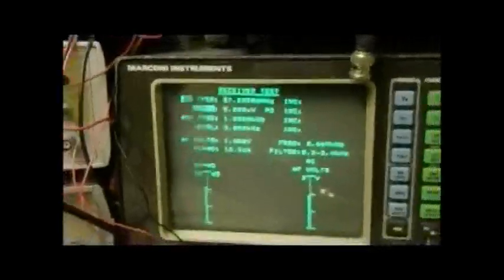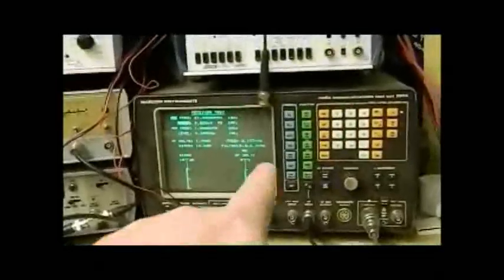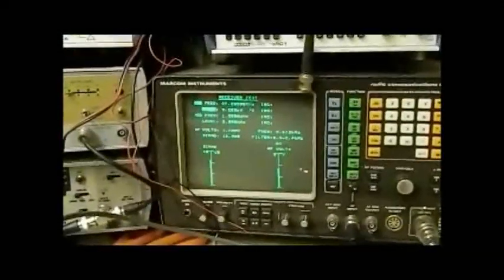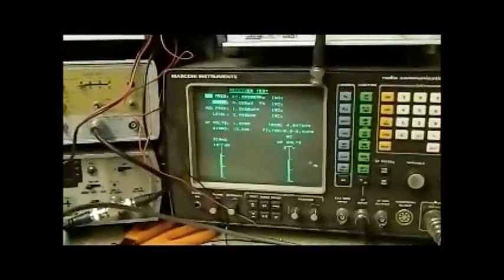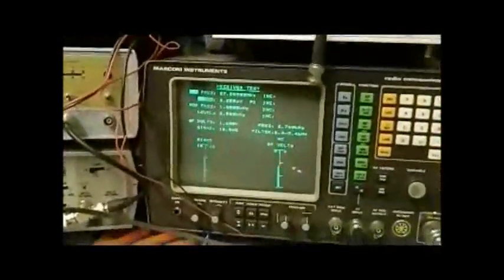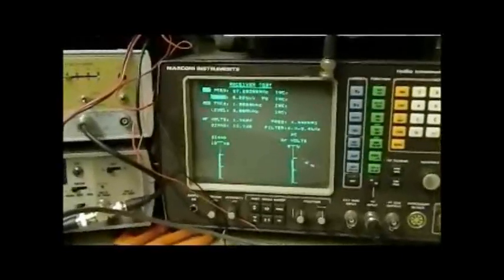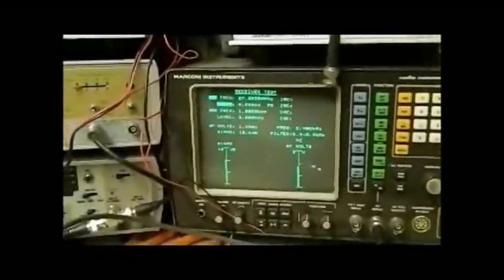It's not difficult — it might help a little bit, but if it doesn't just let me know and I'll try to explain a little bit better. I'll post this and see how you get on with it, Mark. The digital display on the 2955 isn't ideal — it has a lag and flickers between about 11.5 dB and 12.5 dB. But as long as it's approximately 12 dB SINAD, that's pretty much it. I've got an analog SINAD meter which I prefer, because when the needle says 12 dB SINAD it stays steady and is easy to read when peaking the RF section of a receiver.